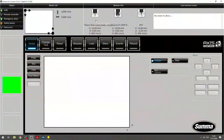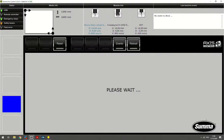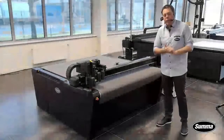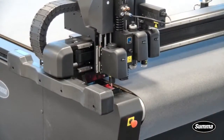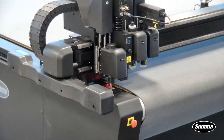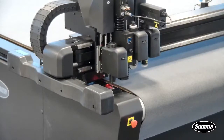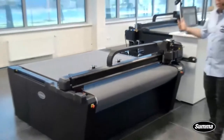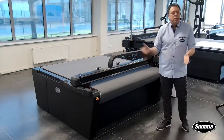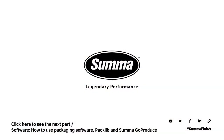So if we go back to our software here, I can simply click on my tool here. As you can see, it's a heavy-duty cutout tool and there is a button here on the bottom right. When I press this, the tool will start to measure on the left ADC. It will do a couple of movements. These movements are there to measure the size, geometry, and make of the knife itself. This will take a couple of seconds. Once that is done, we can then start to continue. We are just in the last test — just imagine doing this with material, going through several tests and choosing the best values. Here, everything is done for you. Basically, when you load up a new knife, this is the first thing you are going to do: it is going to set your knife depth and then you are going to measure your knife geometry.